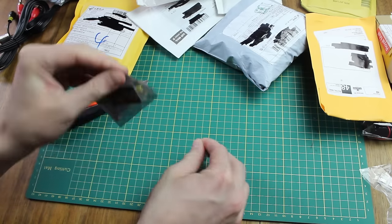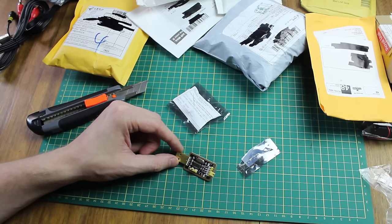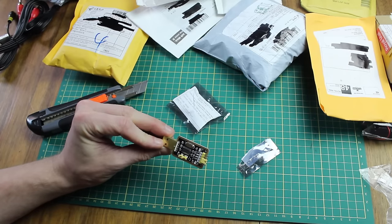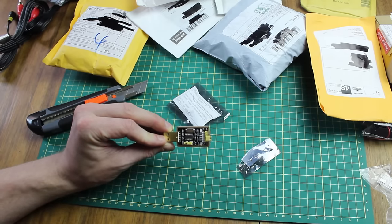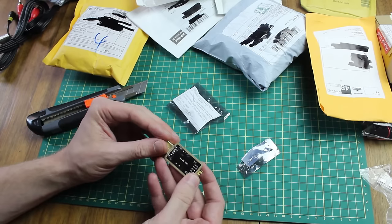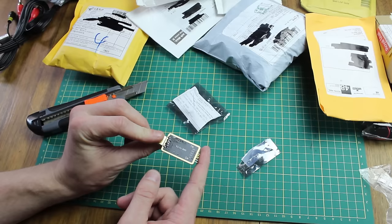This is a little USB to TTL adapter. I like the look of this one because it has a gold surround — really interesting looking. It's just a CH340G with a USB connector. This USB connector looks gold but it won't be. I picked it up because it has a reset button on the board and it's convertible from 5V to 3V logic. I'm going to try and use it to program an ESP8266. It looks fancy and wasn't very expensive.